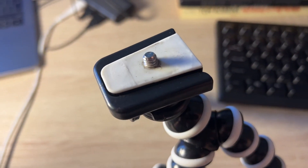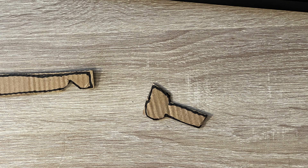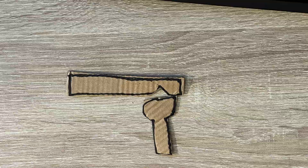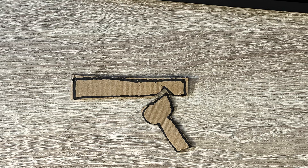The clipping mechanism is pretty simple. This sprung lever is attached to a sticky outie. When you slide this plate in, which has a slot on its underside, it pushes the sticky outie down. When you push it in far enough, the sticky outie reaches the slot, at which point the spring causes it to flick back up, locking the plate in place. To release it, just push the lever.